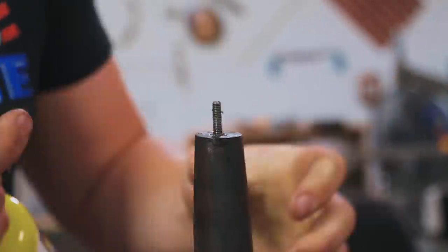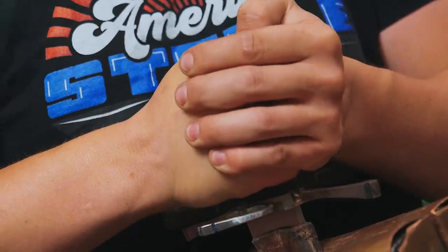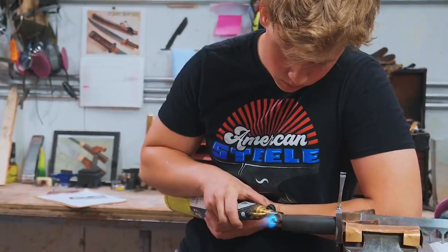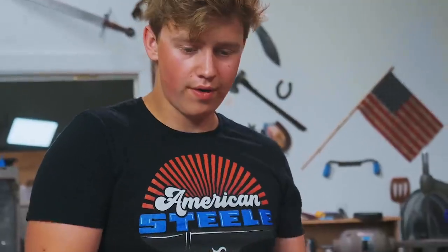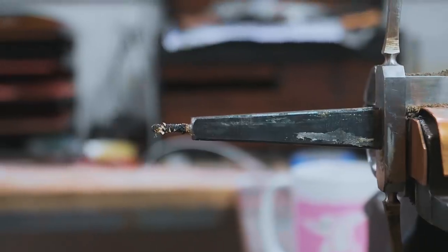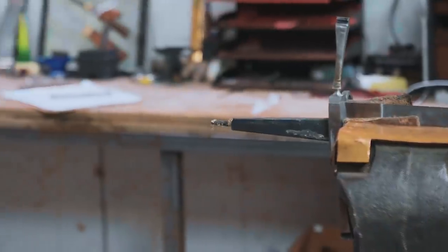We're heating up the tang so that it will melt the paste wax on the inside and we'll be able to pull off that handle. Wow, we were really on the tang there a little bit. Some of that paste wax must have worn off and so it was actually epoxied onto the tang. It must have been contacting there, so the first time I fit it on it wore off the paste wax, but that's of no concern now. What we have is a perfect fitting handle every single time.